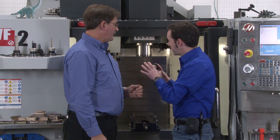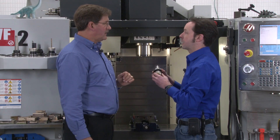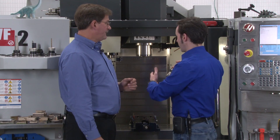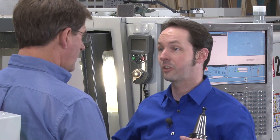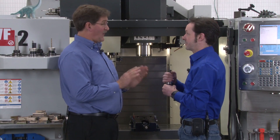How do you know the limit for what you can put through? There are specs in the book — a weight limit, a diameter limit, and a length limit. You read the specs, and if it fits within there, it'll go through the tool changer. But be aware: it's quite possible to put tools in here that you can't run through the changer, and with a big giant one, if you spin it up to speed, it's going to get ugly fast. A little common sense goes a long way.